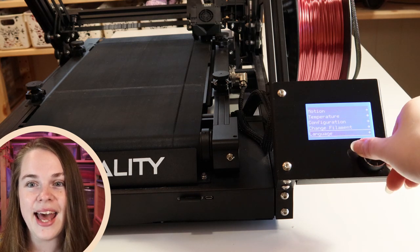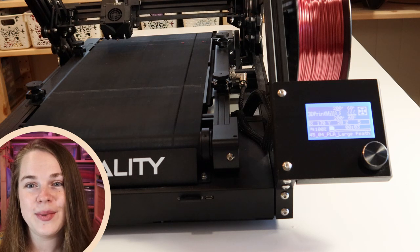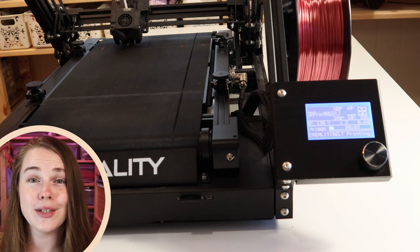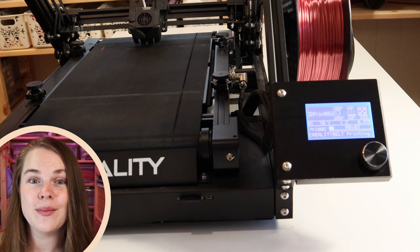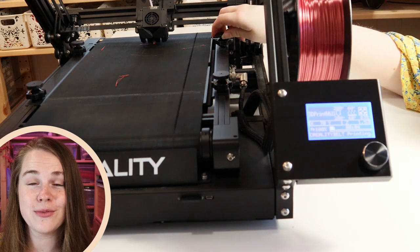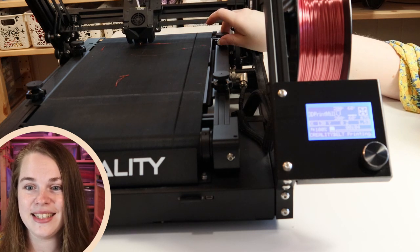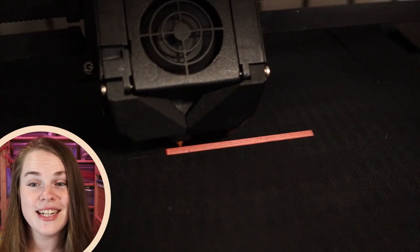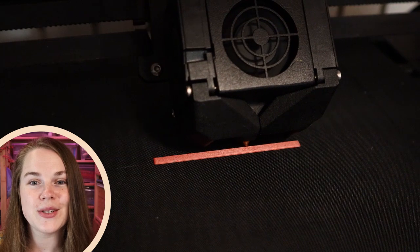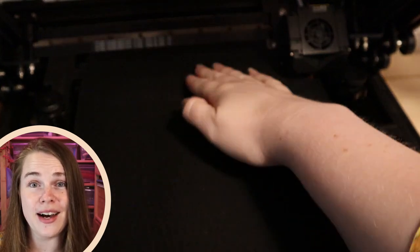Then you can start a test print with a brim at the front — a few layers at the very front — so it heats up, starts printing, and you make sure the line it's laying down is nice and even over the whole surface. If it's a little bit high anywhere, bring the bed up; if it's a little bit low, bring the bed down. I'm adjusting the back here because that side was a little bit high — the filament was really rounded and coming up off the bed, so I needed to lower it back down. You're looking for a nice even level that's not too close and not too far away — not too squished and not coming up off the bed. You also don't want it too squished because it might damage the belt itself, so you should be able to just peel it up with no residue or white spot left on the bed.